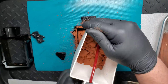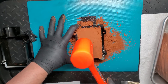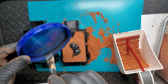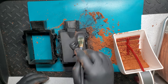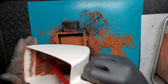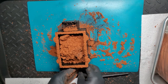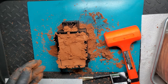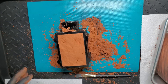On the first attempt, we sifted sand on top of the figurine, which is supposed to help capture the small details of the item you're trying to cast. We then packed sand on top to complete the first half of the mold. We then flipped the mold over and placed the second half of the resin print master on top. We brushed down graphite powder as a parting agent on top of the first flask. We then placed the second half of the flask and sifted more sand to capture the details of the figurine, then packed more sand tightly to get a good impression. This is when we learned about undercuts and why you need to choose a design without them for sand casting. You can learn from our mistakes.